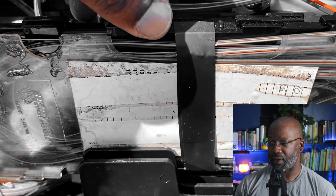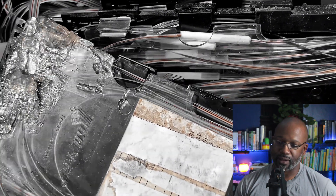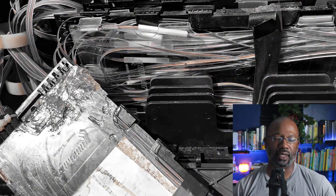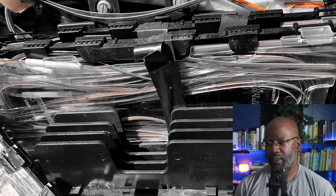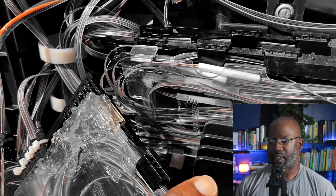The fibers are pretty crammed in there. This is one of the problems when expanding fiber counts inside a pre-existing case. The smarter bet would have been to just replace the case altogether. That leads to another issue — what if there are commercial customers or dark fiber running through here? You just don't want to take down circuits like that. Be conscious of it, plan for upscaling that area in the future, but don't get crazy with it — do what you can and try not to take anyone down.